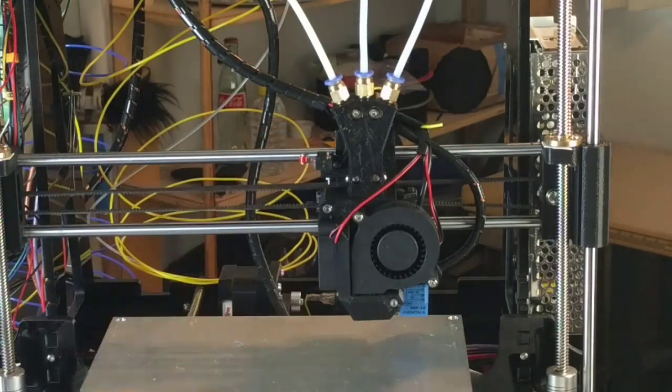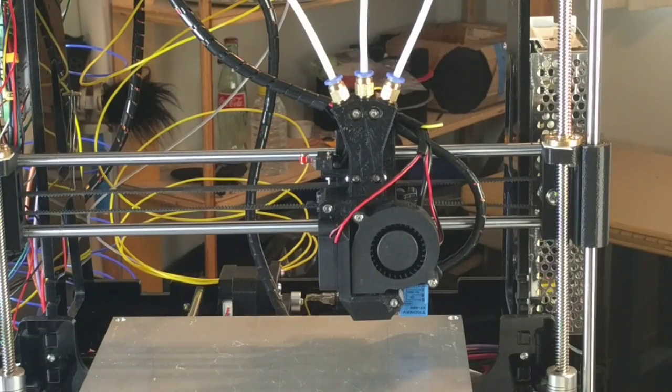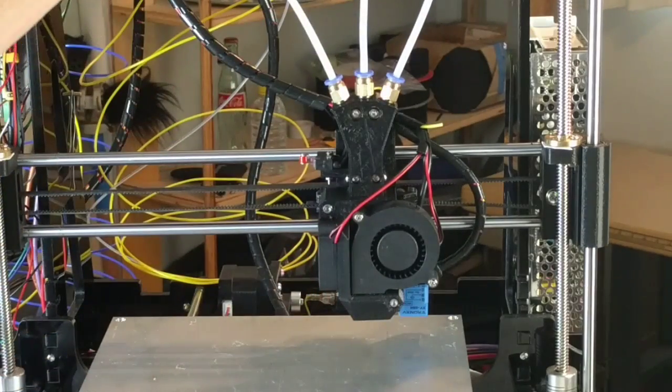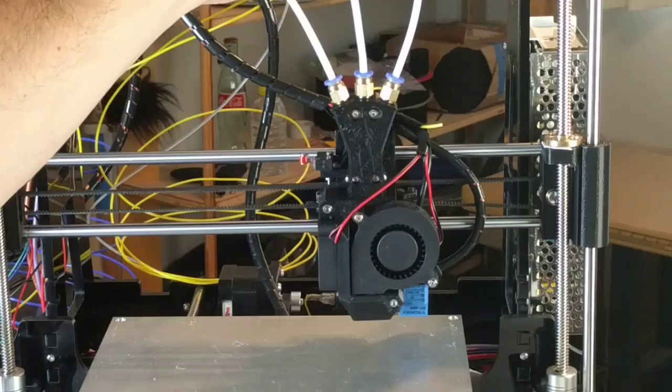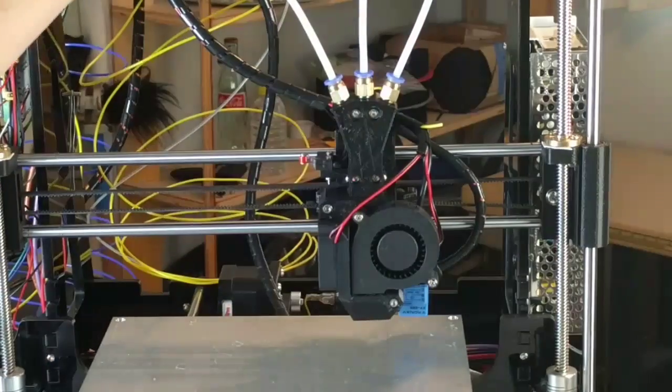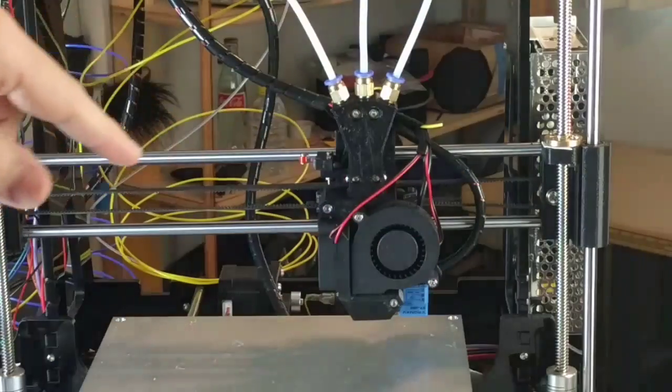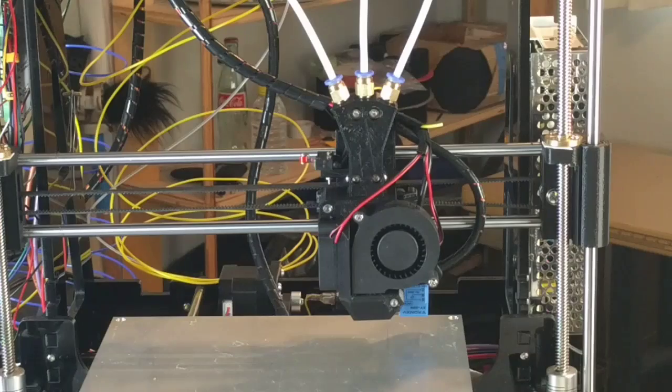I was trying to come up with the easiest solution for getting to three Bowden tubes if you bought this printer. For about $2 for the sensor and around $8 each for the steppers — and the fittings actually came with the stepper motors — you basically just need to buy the steppers, some tubes, that sensor, and the big thing: a new controller board. You can use a RAMPS 1.4 board, but I chose to use a Rumba board.